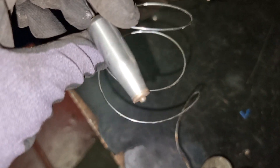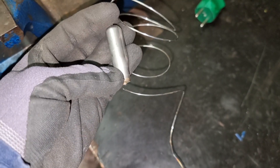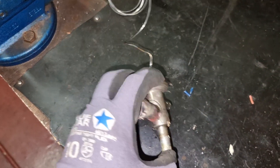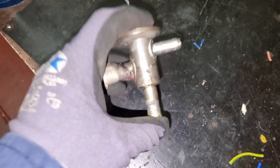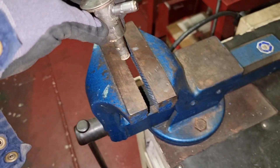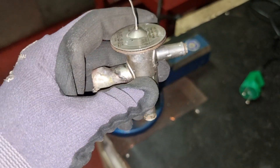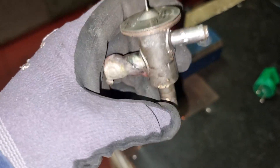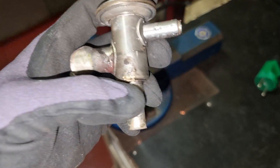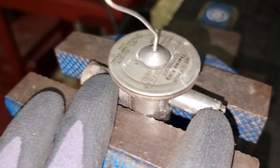This is our old expansion valve, and part of it is this sensing valve. The sensing valve is connected to the outlet of our evaporator, and inside it is a small amount of refrigerant. Since it's connected to the evaporator outlet, the refrigerant will boil inside and regulate the opening of the diaphragm. In a real situation without a spare, you don't need to remove the valve — just follow this instruction. Let's start putting this under emergency operation.